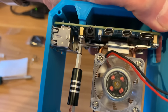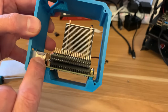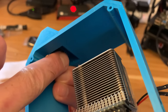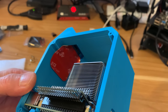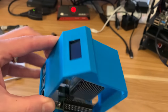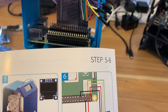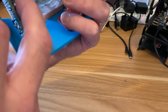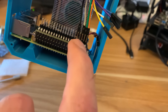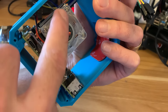Pop these screws into place. GPIO pins can go back on and that goes in much easier when it's in the case because it's all held in place. It looks like the display goes in this way around with the GPIO pins at the top, and it says to fix the display with tape. I've matched these cables up as close as I can — I haven't got a red so I've used orange for red — but the fan cable is too short so I'm going to have to rotate the fan because I need to get those two pins, red and black, on the front.